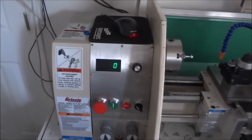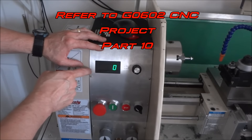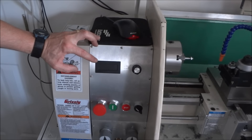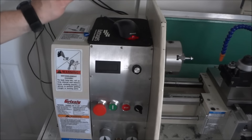I'm really happy with this digital tach setup. If you refer back to some of my earlier videos, you'll see me install the front panel and hook this tach up. I paid like $12 or $13 off eBay for this tach. It operates on 12 volts, so I ran 12 volts to it from my power supply. There are three wires — one power and one signal wire — and I brought the signal wire up to the tachometer and also hooked it into Mach 3 on one of the inputs. It puts out 5 volts — or 2-point-something volts — and that's enough for Mach to recognize the index pulse.